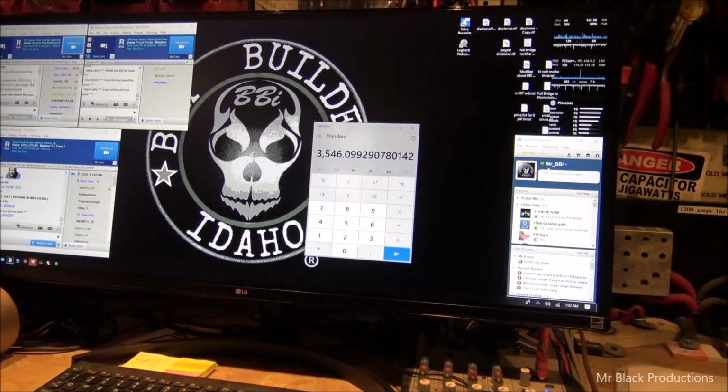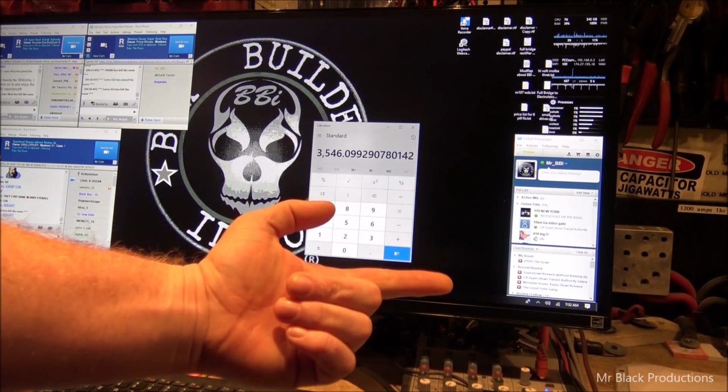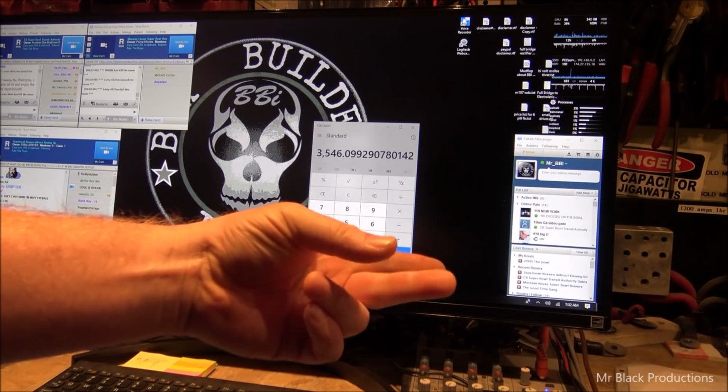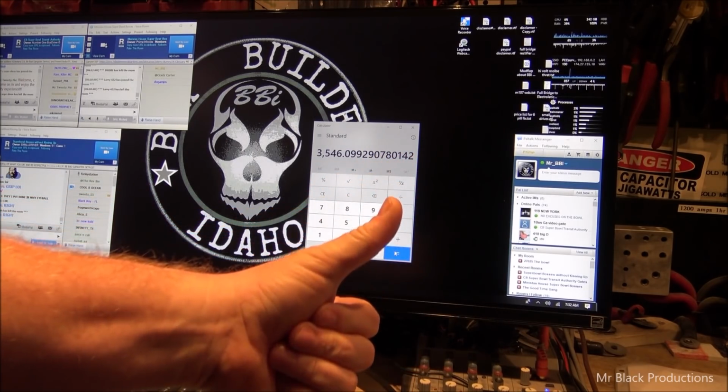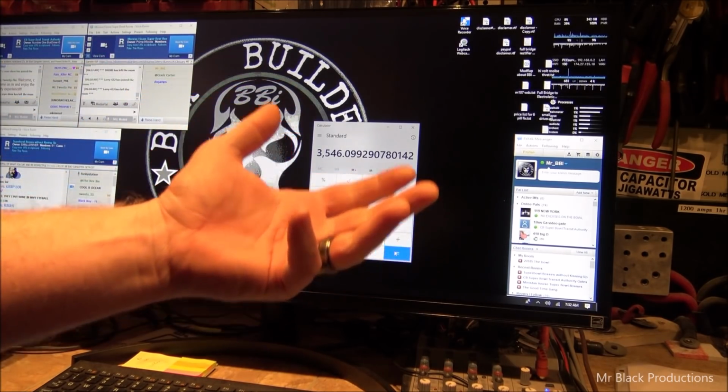Translation: they're going to assume that 30% of the transformer's life is going to be spent in operation, 70% in standby. Most of the time, the way that we use it in radio is to those specs. We will spend 30% of the transformer's life in operation and 70% off. That saves you core, that saves you wire size on the transformer. It saves you all these different things, and it's going to save you weight. So it's going to save you cost in manufacture, cost in design, and cost in shipping weight, which translates into about a 30 or 40% savings in overall cost.